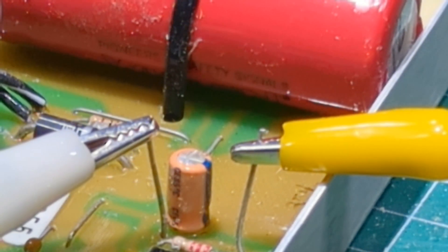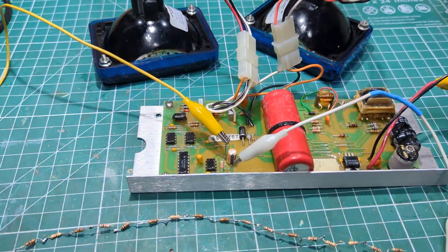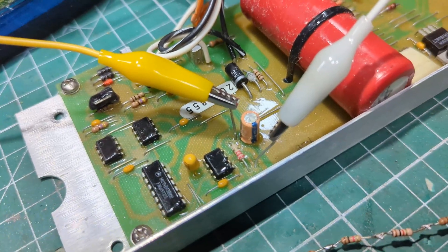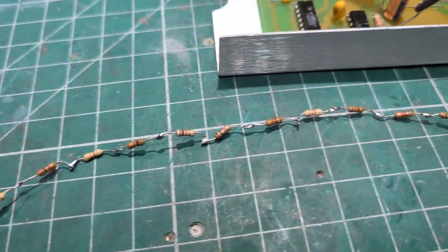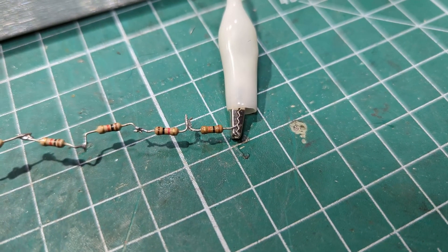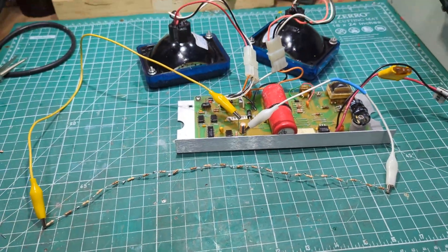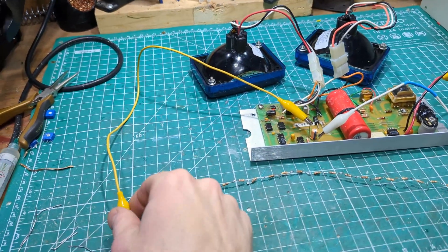That could be as simple as just swapping in resistors to see what we like, but a more visual way to do this is to take a 10k resistor on the far end and then hook it up in series with a bunch of 1k resistors, so that we have a line of them that we can connect in the middle of each one and get an approximate resistance that we can change a little more visually than a potentiometer would.